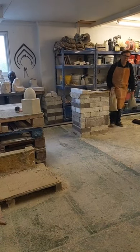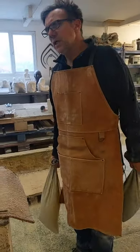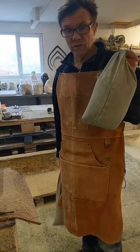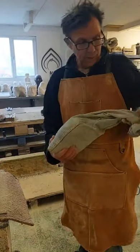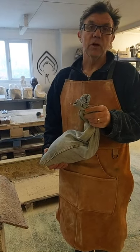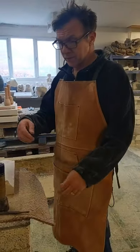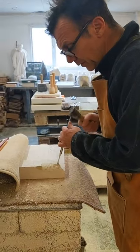This is kind of useful information, because people don't tell you how to hold the work. In masonry, they use sand boxes. So you have a box, but here I use a sandbag. These are jeans legs that have been sawn off, and then Tam sewed the ends up. Then I've used a cable tie on the end once I've filled it with sand. And they do kind of work, so they're brilliant. They make a hell of a difference, and it's much easier to work with a piece of material.